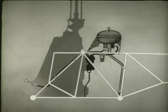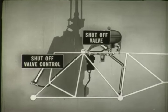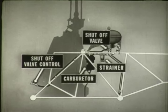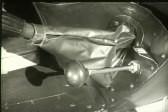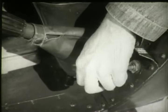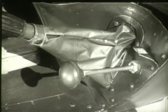This model helicopter has one fuel tank mounted on top of the fuselage adjacent to the main transmission. Fuel is supplied to the engine by a gravity feed fuel system. Fuel flows from the tank through the shutoff valve, which is operated by the control knob to the left of the pilot's seat, then through the strainer and into the carburetor. The fuel system is serviced from the left side of the helicopter. Pushing the knob in opens the valve and allows fuel to flow; pulling the knob out closes the valve and stops the fuel flow.